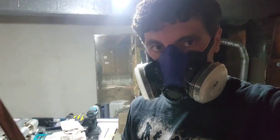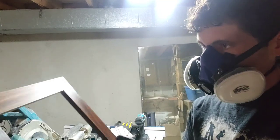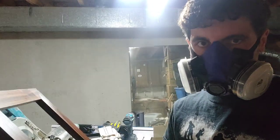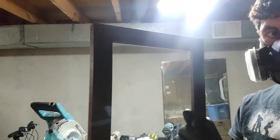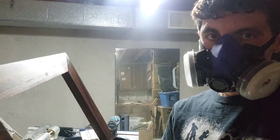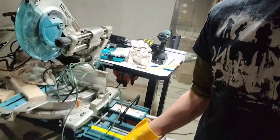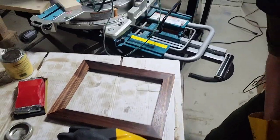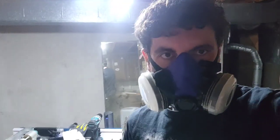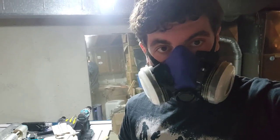This is the third and final coat — you could do this forever, but really at a certain point the wood is saturated with Danish oil and all you're doing is getting it to shine and feel smoother. You can see I still need to rub the wood a little more to get a bit more of a shine — you can see some spots where the oil is sitting on top of the wood. A lot of the finishing is just using a cloth and rubbing and rubbing. I think it's turning out really nice. I thought folks would be interested in how to build a frame.